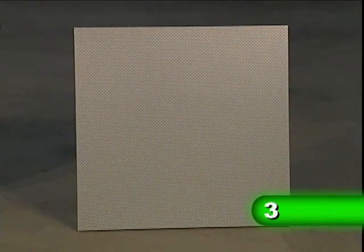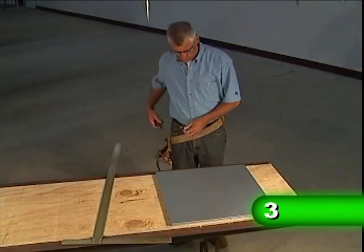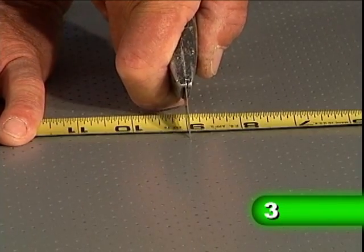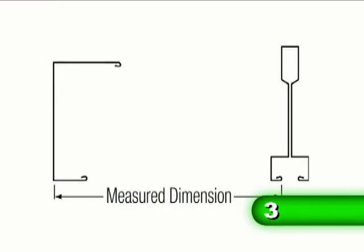To create perimeter panels, full panels need to be cut to fit the perimeter spaces in the grid installation. To create each perimeter panel, measure the size of the full panel to be cut and mark the cut point. Note the measurement points in this graphic.